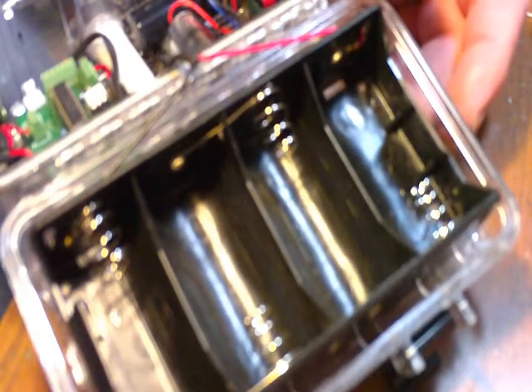And that's pretty much the build. I made a cover that I can put in so my batteries, if they fall out, are not going to short out my board, and it keeps my fingers out of where they're not supposed to be. I'll also camo it. If I decide I want to make an infrared version, all I've got to do is put some infrared material over the top — infrared material will be black, I just have to cut it, glue it in, and it will pick up infrared. So you'll extend your flash range for infrared.